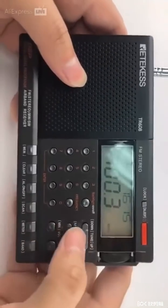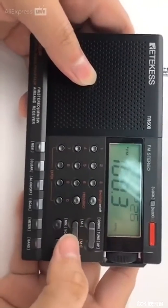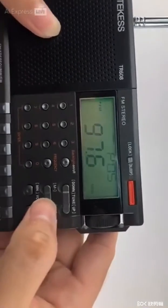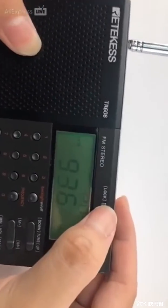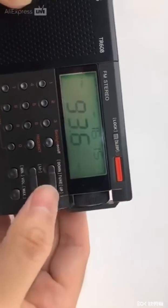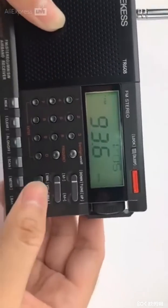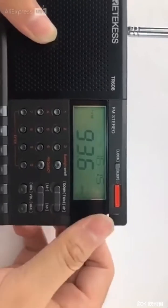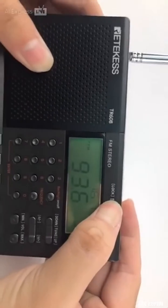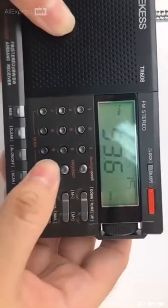In order to prevent misoperation, this radio is provided with a feature to lock the menu control and all of the push buttons, to lock the surface control key. Press the locking switch key. If it is displayed twice and the locking indication lock flashes quickly, it means that the radio is in a lock state and other surface control keys do not work. Now it flashed quickly, so we can't press any key.